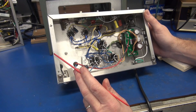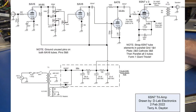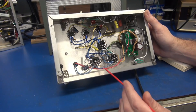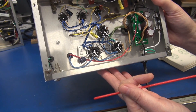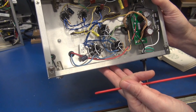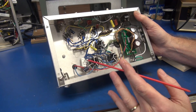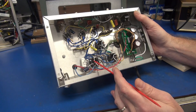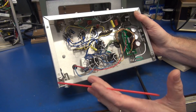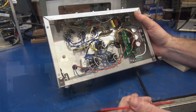If you look at the schematic you'll see that I did not show the wiring of all three tubes — I simply referenced it as '6SN7 times 3.' Take a close look at how I did this when you're ready to wire yours up — just follow the map. You could actually build the same circuit using one output tube, say a 6V6, but then you're back up to the cost of a $22 tube. The 6SN7s are probably $0.50 a piece and these preamp tubes might be a buck, so we've created an amplifier where the tube cost is under $5.